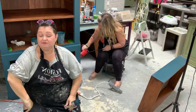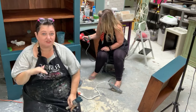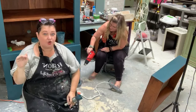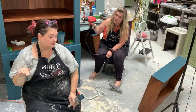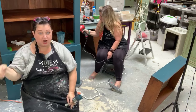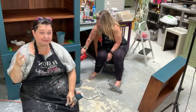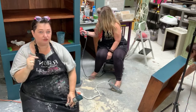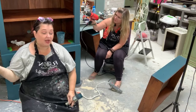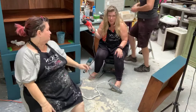Stop that. Anyway, besides that, the reason we don't prime things on camera is because for a primer to truly work, it is supposed to sit and dry overnight. It really needs to sit and do its job. And you should have two good coats. The first coat should dry for at least an hour, and then the second coat should dry for at least 4 hours. And you can see that that would be really tricky to do in a 1 hour live show. We're good. We're not that good.